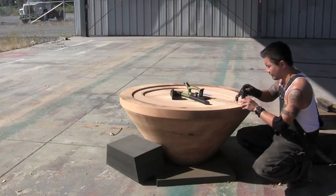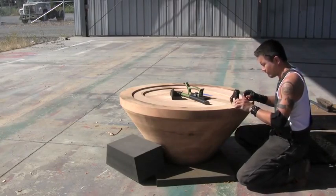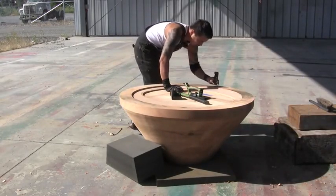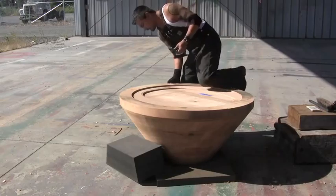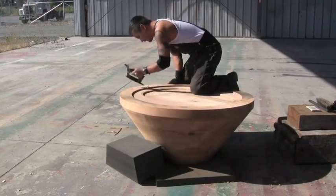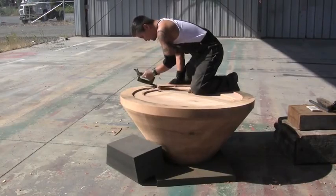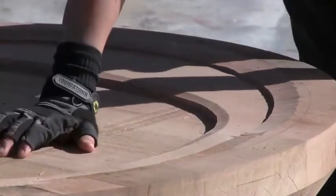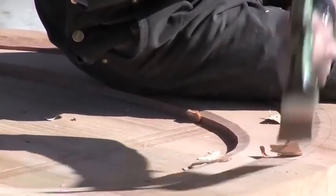Here I'm laying out the secondary outside bevel using an offset compass to establish that line. On the inner line I used the elbow adze, but I decided to use the D-adze for this. The D-adze gets its name from the shape of the handle — this one's in the shape of a canoe — and it was actually made for me by my uncle Jerry when I designed a new blade not too long ago.